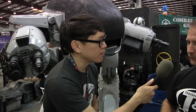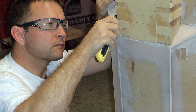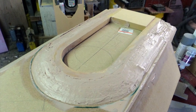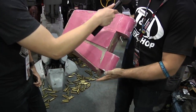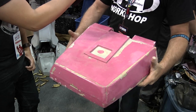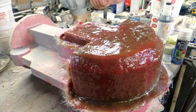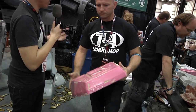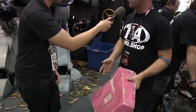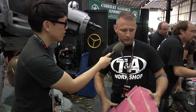After deciding on the scale, the next thing was picking out processes — what to make it out of. The prototypes were actually done out of things like MDF and styrene, really cheap materials I could work with in a hurry. I painted them an instantly recognizable bright pink. You can see them just sitting outside — the weather's kind of taking them apart already. Once I had the prototype parts for the big pieces, the next step was to pull molds and fiberglass and lay up all the lightweight big open parts. You didn't want it to be full of MDF and styrene — that's really heavy, and it'll get wet and things start falling apart. Everywhere the paint's peeling is a seam that's about to come apart.